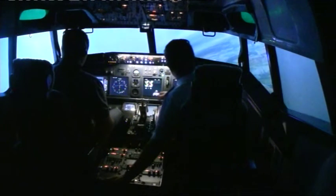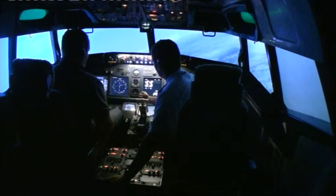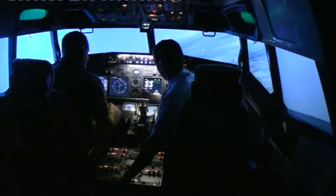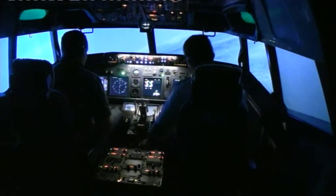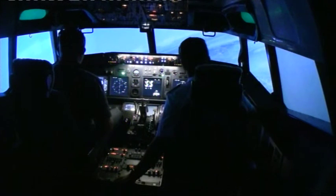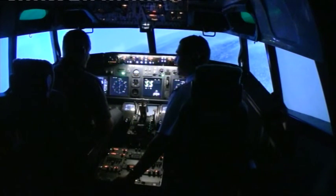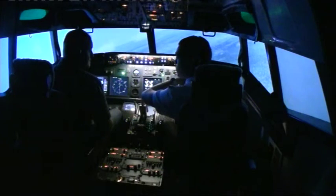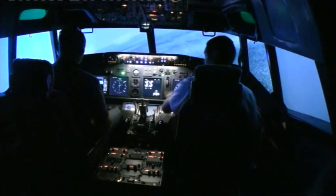Next one, down the left here, bring this speed brake lever up just to unlock it, and back about half a centimetre and just release it there, okay? And that's going to arm it. That's it. That's good. What's going to happen as soon as we land, this lever's going to come all the way up automatically after landing, and it's going to bring our spoilers up, those things on the wings, okay? So that's good as well. Slow us down, eh? That's what we want as well.